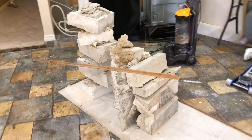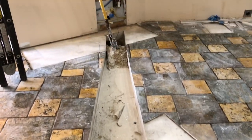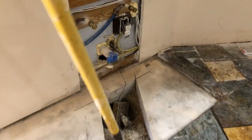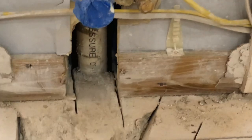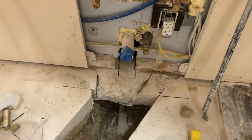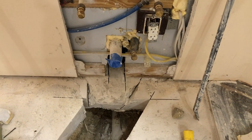That there is the amount of concrete that came out of there. I had to cut it again because I needed a really straight line back to that drain. It came out pretty good — I found the pipe right there. It's covered in mud but there it is — there's the drain. I can find it in the wall. I'm going to have to hammer that out. I tried to cut it with a couple different saws and nothing's really working, so I'm going to drill a bunch of holes until I can chop it up with a hammer.